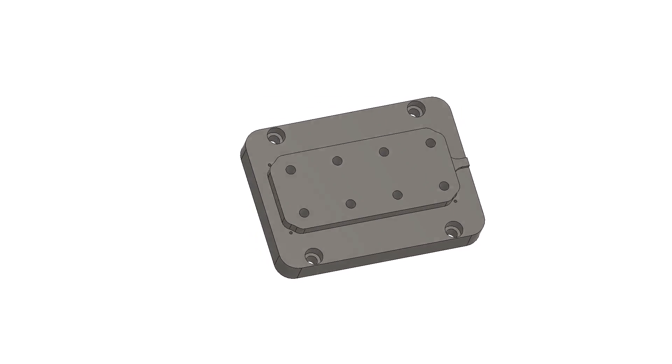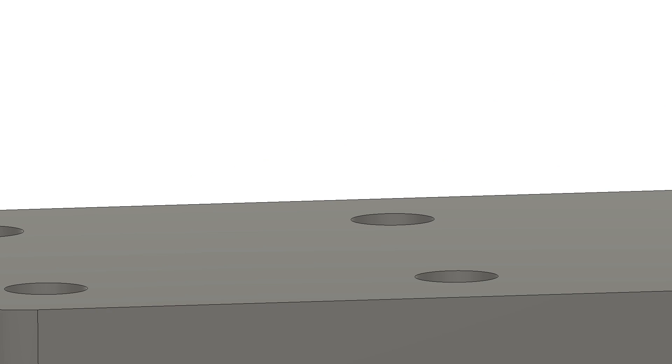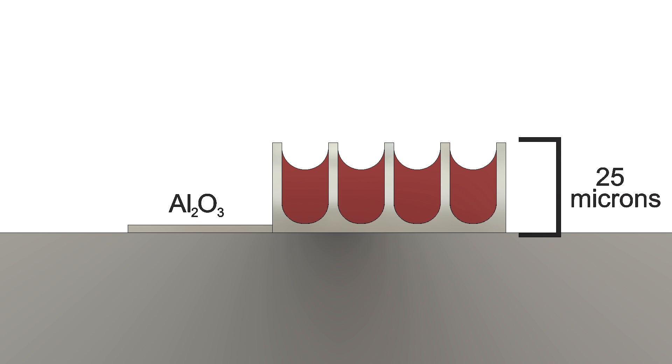Now we're ready for the magic, so let me quickly explain how it works. Our original aluminum part naturally has a very thin oxide layer on it. By placing our piece in the acid and running electricity through it, we're forcing the growth of these hexagonal nanotubules which grow much taller, giving us a thicker aluminum oxide layer. This makes the part much more scratch resistant. Next we place our part in a bath of dye, so when the dye is trapped inside these pockets our piece comes out looking colored.